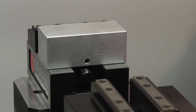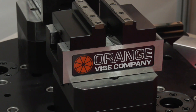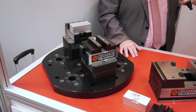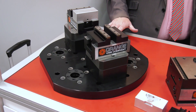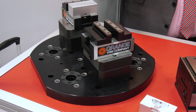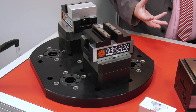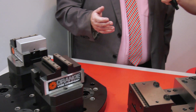Very quick and simple to use, as you'd expect with the Orange Vice system. There's a zero point system here - what we have is a sub plate that would typically be on a regular machine tool, onto which we put the Orange Vices either directly or using a riser to lift them to the required position. Underneath the vice, we can incorporate Orange Vice's own ball system for zero point, but equally it's offered so you can simply bolt it down, or use what's become the industry standard four-pin QC system with a 52mm pitch. It will also be completely interchangeable with industry standard.